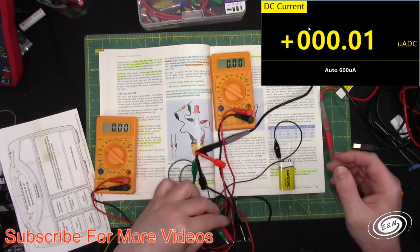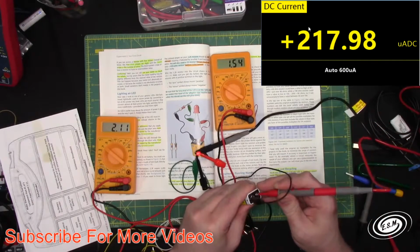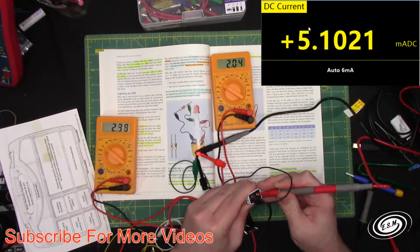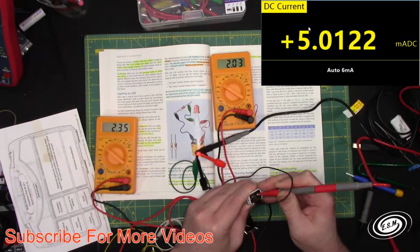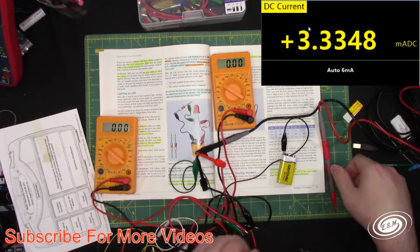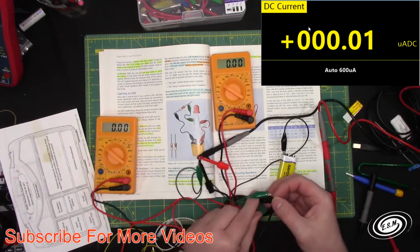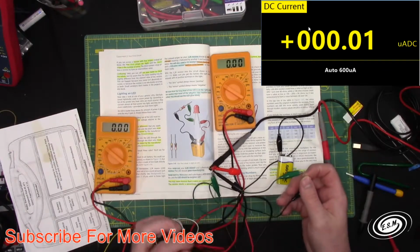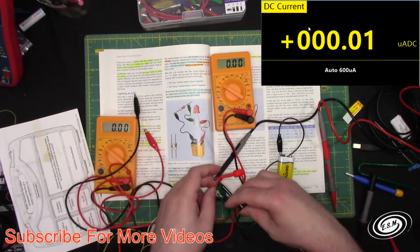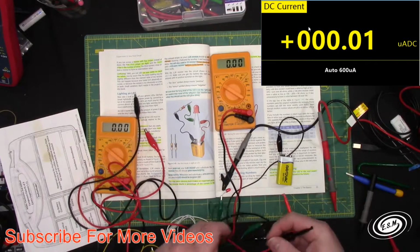Okay, so now we have that hooked up, and this should draw more current. And it is going to draw 5 milliamps. So, draws a little bit more milliamps. It's definitely a lot brighter. What I'm going to do is pull these meters off, these voltage drop meters here, and see if that affects the brightness of the LED.